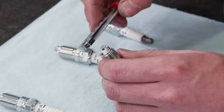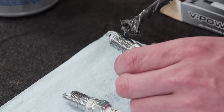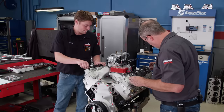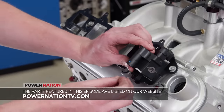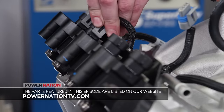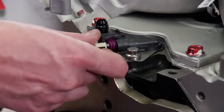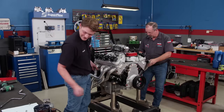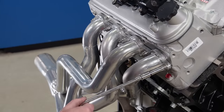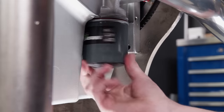We'll set our spark plug gap to 40 thousandths on our NGK TR6 plugs, with a little anti-seize on the threads. We're using OEM coil brackets to hold down our new Blue Streak ignition coils, plug in the Holley coil harness and MSD sensor harness. A set of ARP header studs holds on the LS dyno headers, and a MicroGuard Select oil filter finishes everything out.